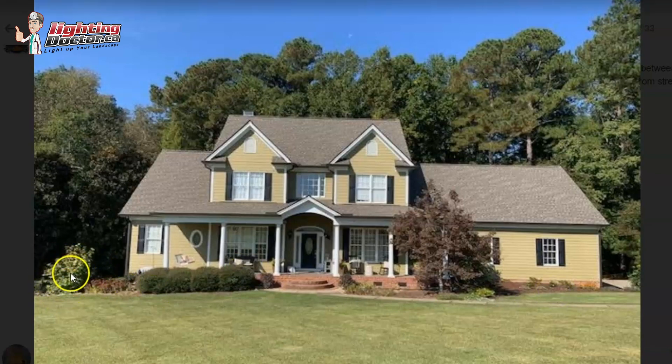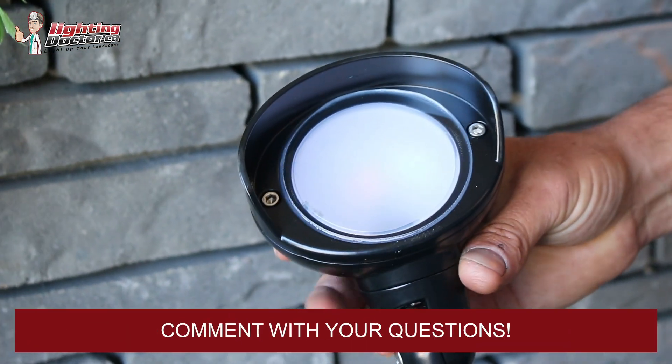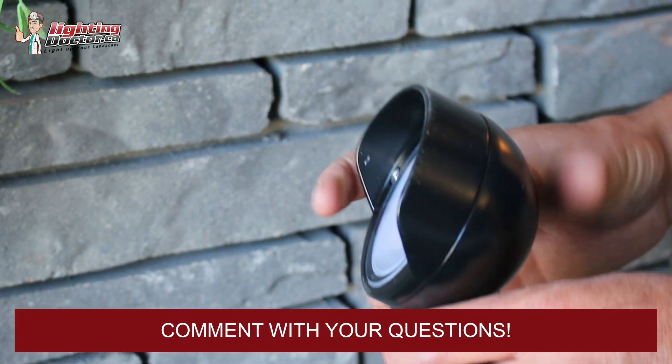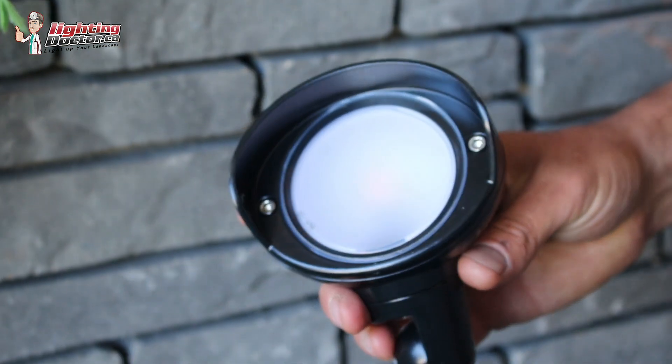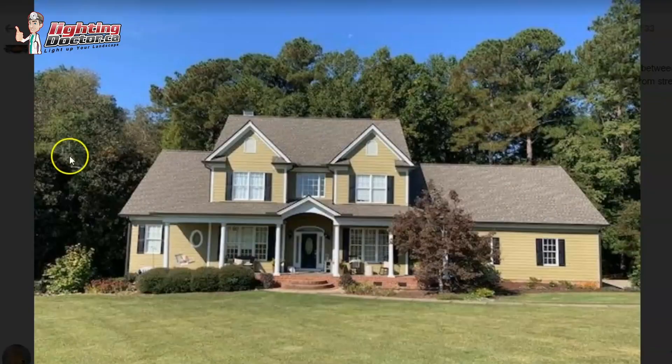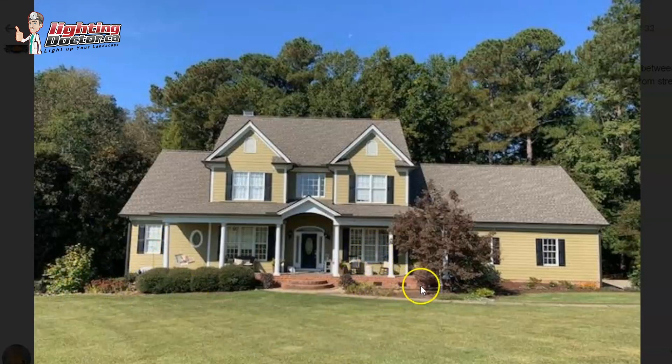Over on this shrub, I would probably highlight it using a wash light rather than a standard up light. Very similar to an up light, it has a drop-in LED lamp but it's a wider angle — about a 90 degree spread — much softer and great for any low-line shrubs so you're not creating hotspots. I'd probably have one on that shrub and then sprinkle in a couple of path lights in between where you have your accent lights. Depending on how much room you have in front of the plants, I'd try to get one in here, probably another one over there, and another one near the up light. I don't think you necessarily want them much further down the pathway because you don't want path lights sticking out of the grass — it becomes a maintenance headache.